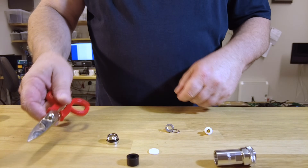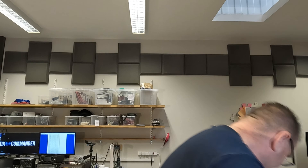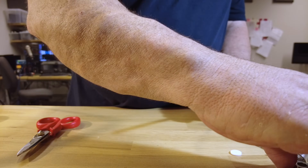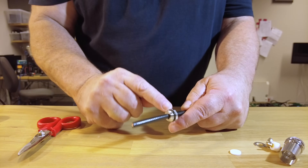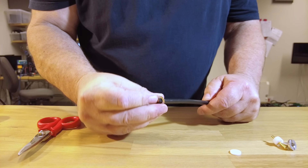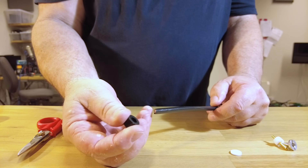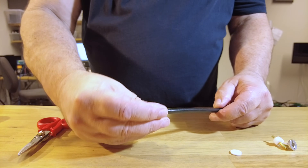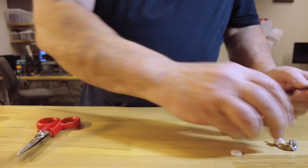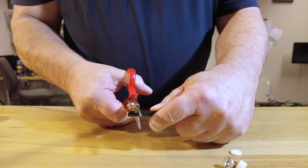Messi and Paoloni sent me these scissors to cut their coax. I'll find the coax which is on the floor and we'll start assembling it. We start with the back of the plug - there's a rubber grommet here as well, then a metal washer so that when we start screwing this in it doesn't actually screw the grommet down. We'll put that aside.